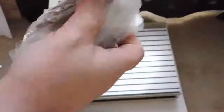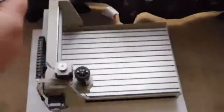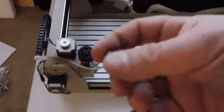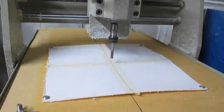Here are those clamps — they aren't real good. Like I said, they hold the work in place but they don't do a great job. It also came with wrenches for changing out and adjusting the collets. There's the collet it comes with, which is an eighth-inch collet. I bought a set of ER11 collets for it that go all the way up to a quarter inch.